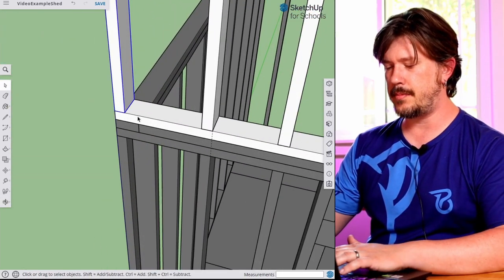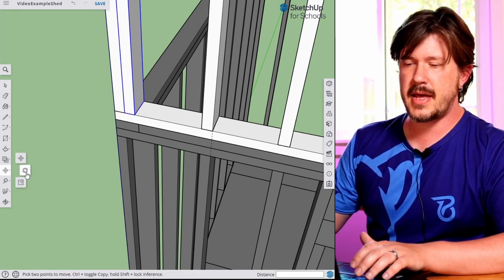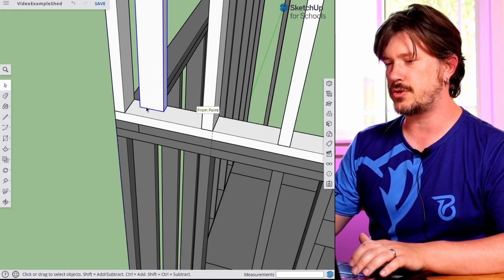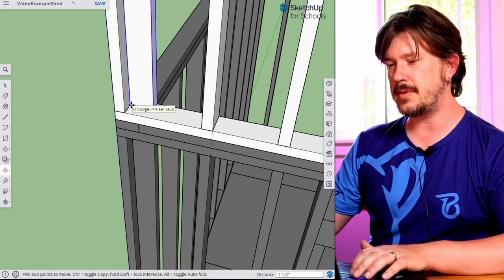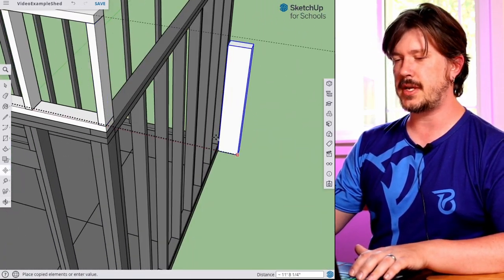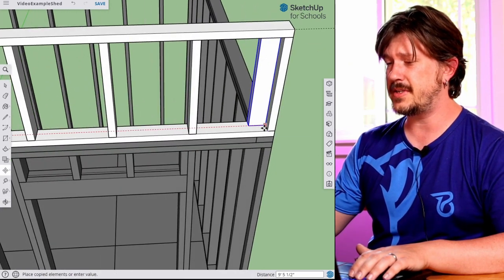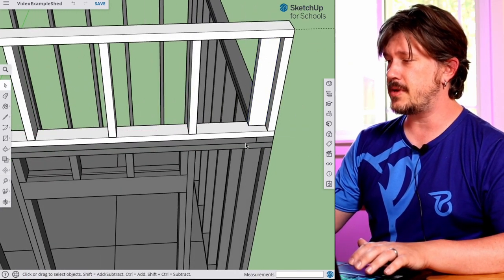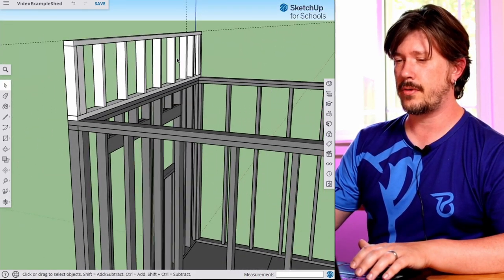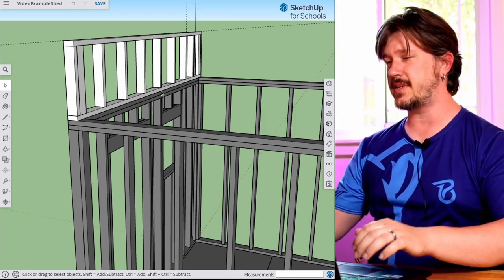All right, like down below, I want to have a sideways stud in these corners. It may or may not be absolutely necessary to do something like this for such a short wall, but again, I'm doing it because it makes me feel better. I know that it's going to strengthen my corners, and for the cost and effort, which is fairly minimal for a piece like this, it's going to give me more peace of mind. So there we go. We have a little two stud corner there, and that is just going to help keep that riser from racking side to side.